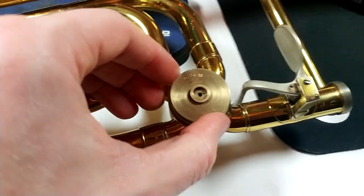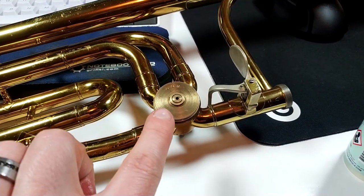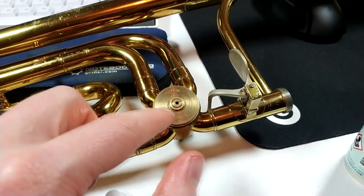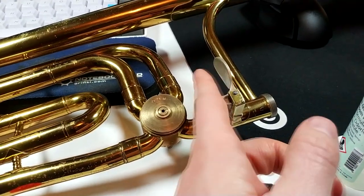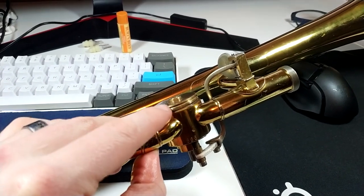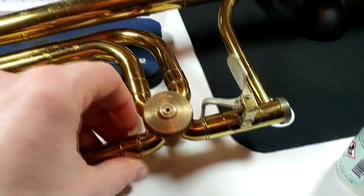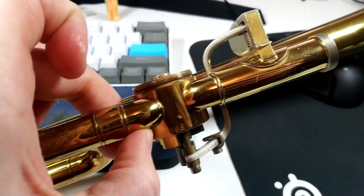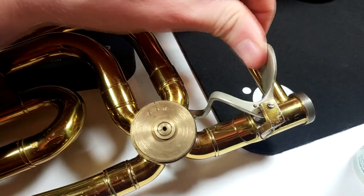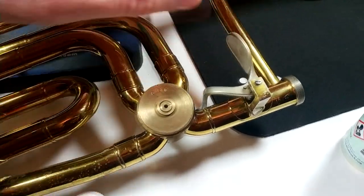Now I'm going to put the valve backplate on and try to line it up. And now is the hard part — you want to get this seated just right, basically hitting it softly on all edges with a nice soft mallet to make sure it seats perfectly. You can check by moving the valve: if it doesn't move, it's not seated right; if it does move, then it is. You can also tell by looking at the edges — if they're even all the way around and flush against the casing, you're good to go. That took all of two seconds because this one is not tight enough to need a hammer. It moves perfectly — no binding, no noise, I can't feel anything as I move it back and forth. So I'm basically good to go.